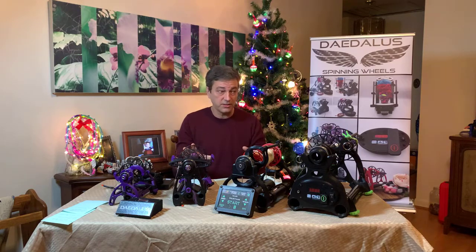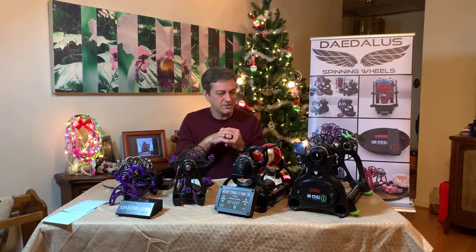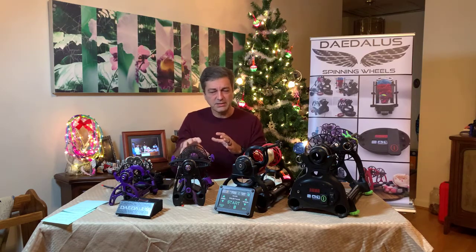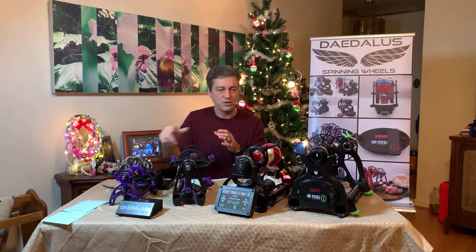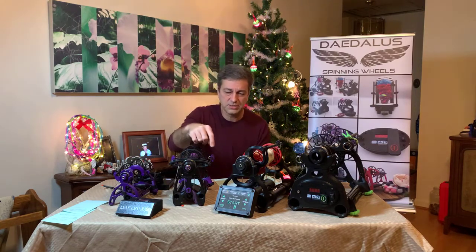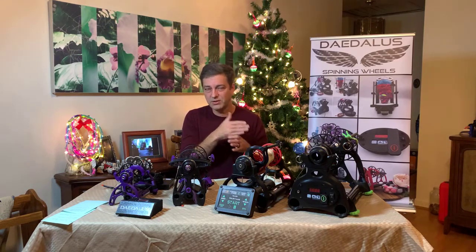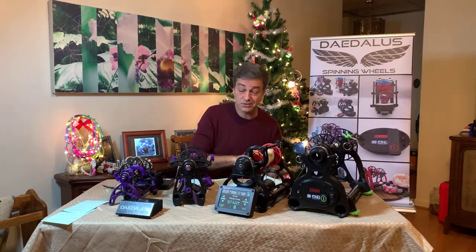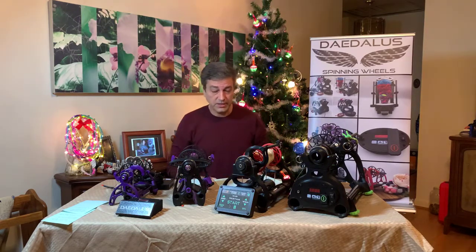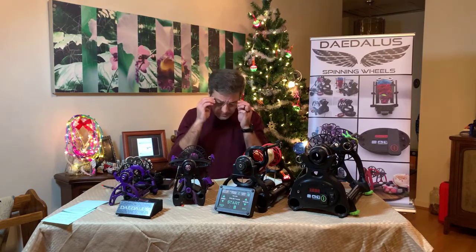So definitely no PLA. You wouldn't want to use PLA on parts that rub together necessarily. ABS is a little bit better for that. But in my designs, anytime there's a wear component, I try to make sure that it's metal. So like all the yarn path only touches steel, because even ABS can eventually wear down if yarn is dragging across it. And so that's why I use ABS. It's harder to 3D print, but it makes a solid product that lasts. And so that's what I'm into.